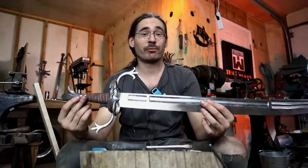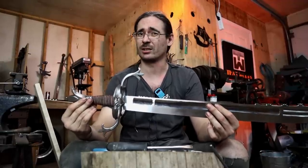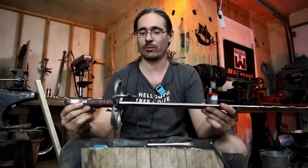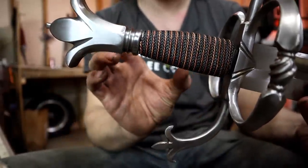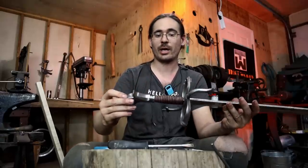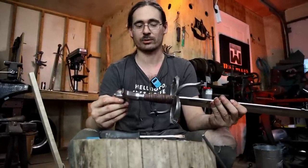Alright, so this concludes the final stage of the vlog series of making Falagrim. There's a little bit more work that you will not get to see in the vlog, but will see in the final cut, which will include Skallagrim's demo, so on and so forth. The stuff that's necessary are two bronze or silver caps that trap the wire. Those are usually very nice. Antiquing of all the pieces, a little bit of hand sanding here and there, and the final sharpening. The other thing that needs to happen is thread at least this much of the tang so that it can have a pin block right here. Other than that, it is a fairly sincere version of the Italian falchion, which we used as the founding piece for this project.